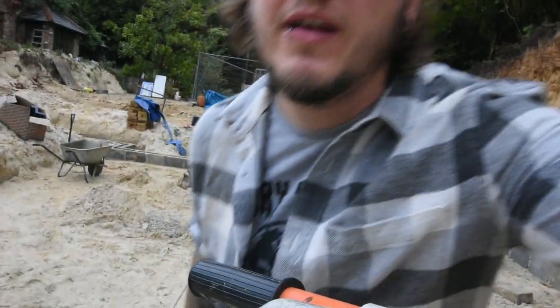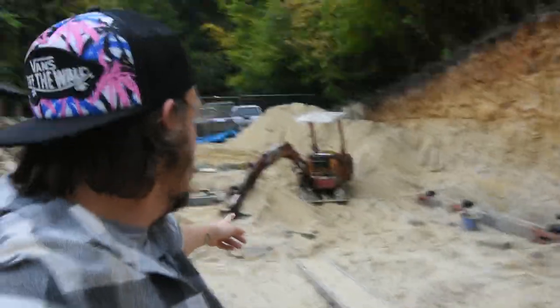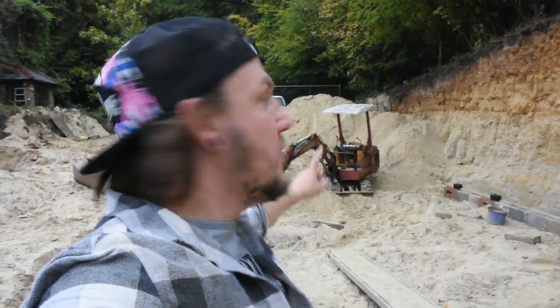Well, there we go - it's Friday. Brings us to the end of another week, another episode. As you can see we've got rid of all of this dirt - this sand, sorry. We've got all the air bricks in on this side of the build, built in with engineering bricks. Engineering bricks provide more strength - they're a lot stronger than normal bricks. They are not as porous, so they repel water rather than absorb it. They're all in. This is what a telescopic vent looks like - this side is down there, and then this side goes outside of the wall, as you can see here.